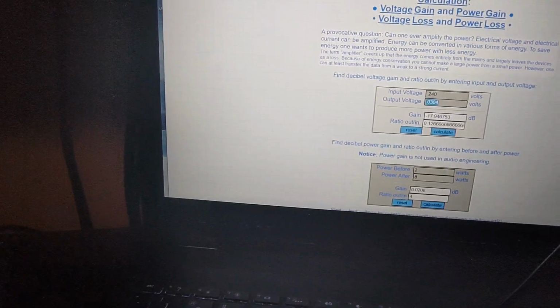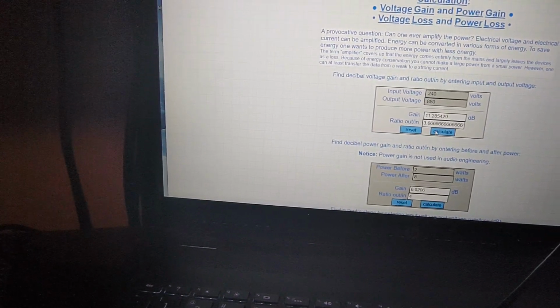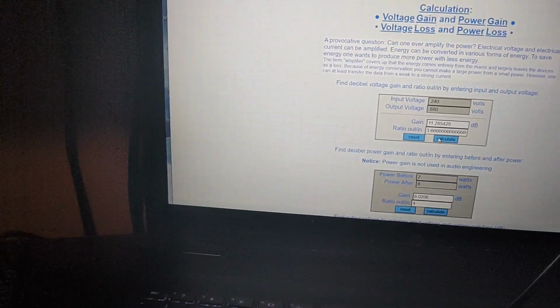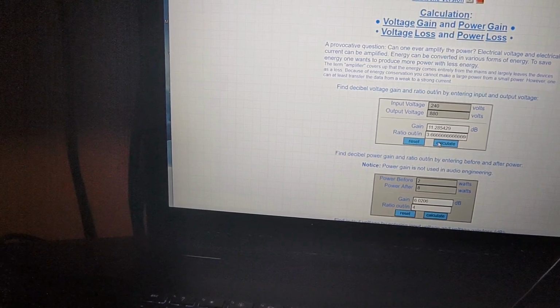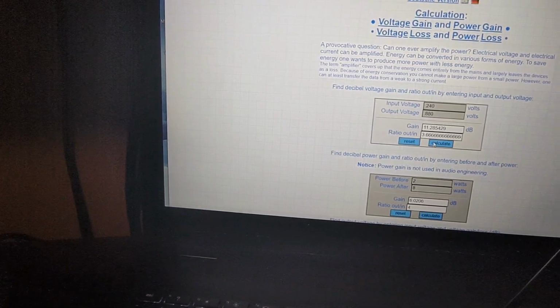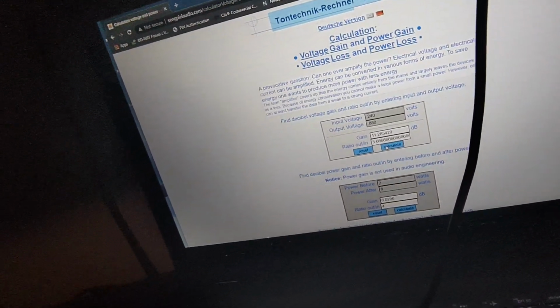If I only got negative 12 or 13 or even 14, in my head it's probably bad. Let's check the upper range now. 0.880. Again, on the upper end, we're only getting about 11 dB of gain. So we're seeing some commonality between amplification at our bass range and our mid range, and I wonder if that will carry over to the high range. So the next thing we have to do is set up for high range, which is any frequency greater than 8.7 thousand hertz.